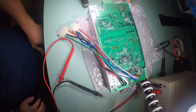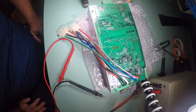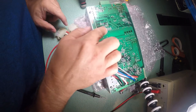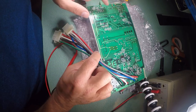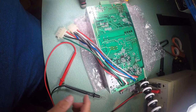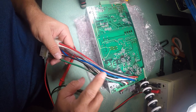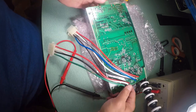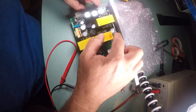So I don't think this meter does capacitance. Picofarads, no. This meter doesn't. Let me see if the other does. You know, I think we've got a problem with some of these capacitors. I see 1, 2, 3, 4 of them that are bad, maybe 5. I shouldn't see any corrosion on the bottom of these capacitors, but I don't have the meter I need to measure them in the circuit, and I don't want to go soldering anything that I don't absolutely have to solder. So I'm going to pause this video, but I want to do just a little more look-see.